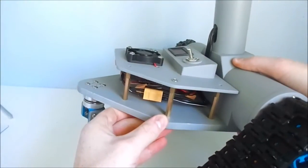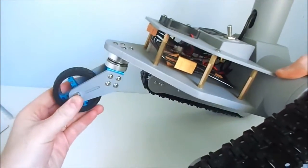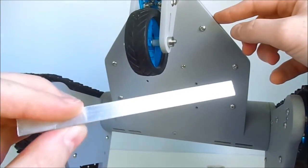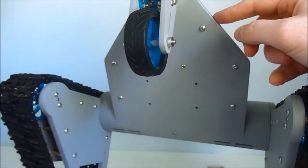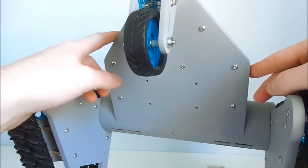Another important piece of the chassis is this base, which combined with this caster wheel helps on the stability. The base is made out of high impact polystyrene sheets, reinforced with aluminum channels in four spots. Five layers of 2mm thick polystyrene sheets were combined.